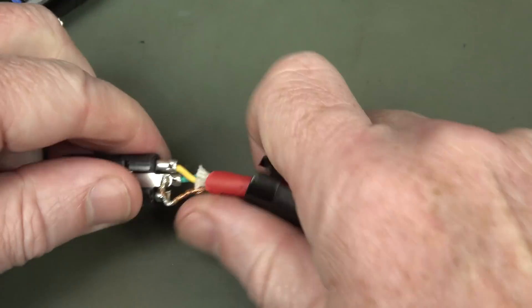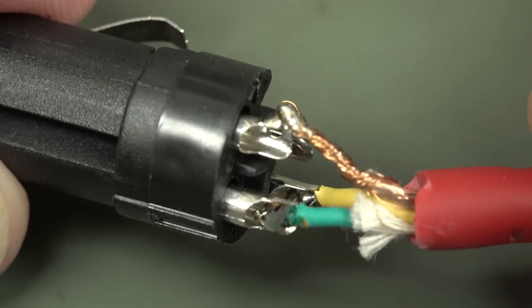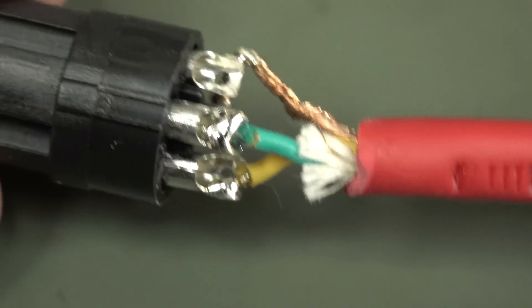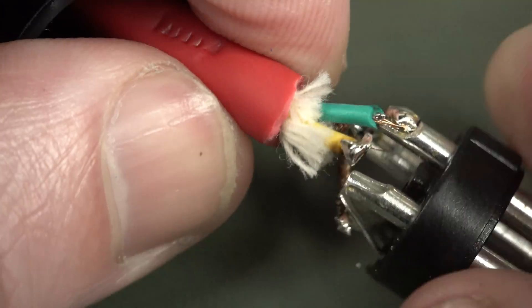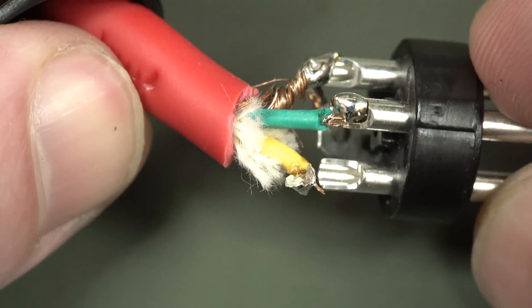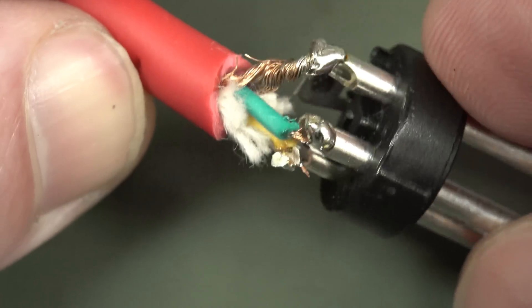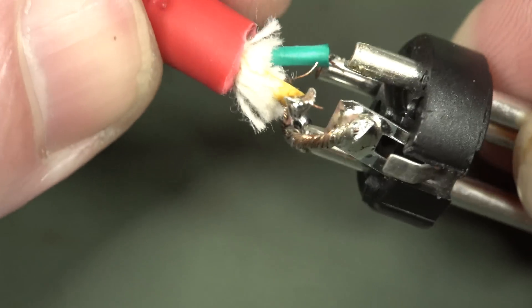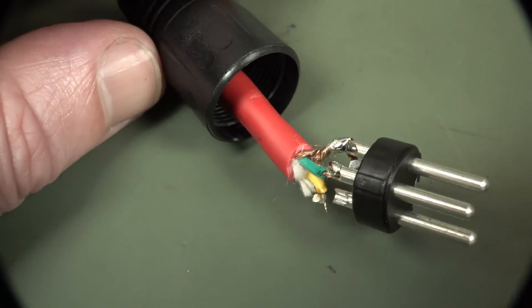You can see down in there. Does the soldering look reasonable? I'm just going to put my macro lens on. Hard to see on the screen here. But anyway, that held up to my abuse of pulling it. They've melted some of the insulation there. The cable feels alright, but this one over here is broken. I swear I didn't put much force on that. Look at that solder connection there - that one's not quite dry as a dead dingo's donger, but it's not far off it. Terrible. That is just crap quality soldering.